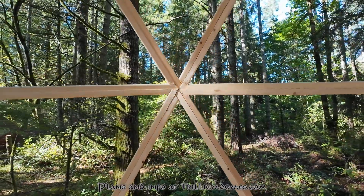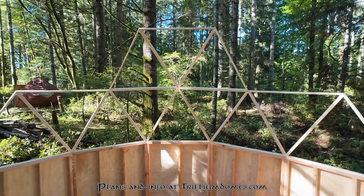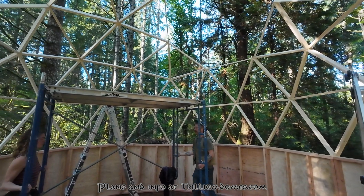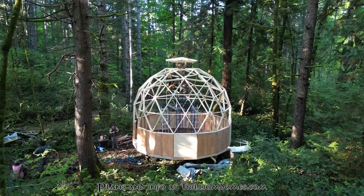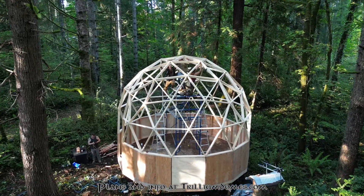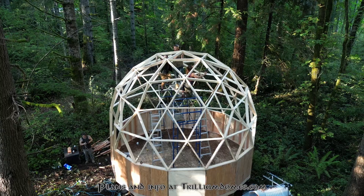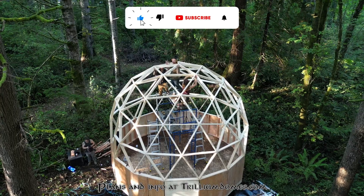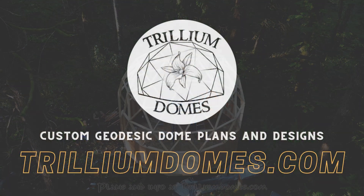Assembling a deep frame dome is basically the same as the beveled method or any other method — you just screw the panels together in the configuration shown on the plans. You could use through bolts and nuts with washers instead of, or in addition to, wood screws for these connections. This is a fantastic way to build a dome without needing a table saw, while achieving the strength of a full-depth framing member plus insulation potential. Thanks for watching this episode of Domecraft — in the next installment we'll be talking about deck framing. Please put any questions or thoughts in the comments below and I'll happily respond.